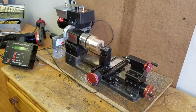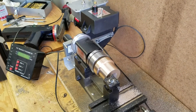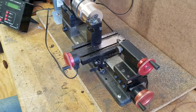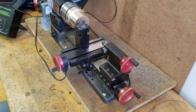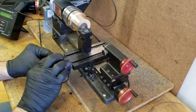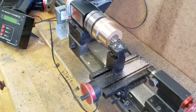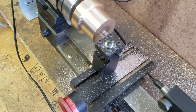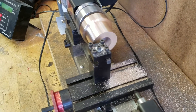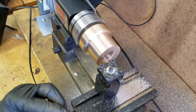Here, as you see, we are making the actual radiator cap. We have the old Kissel 6-38 radiator that we procured, but there wasn't a radiator cap and the neck of that radiator had pretty bad threads in it. So part of what you're looking at is the fact that I've made the portion which is going to be threaded — that's the portion we're boring — extra long, in case we decided we were going to thread it that far onto the radiator neck. However, as we researched this more, we came to the conclusion it was highly unlikely that they made the radiator neck as long as you see here. Nonetheless, we're going to continue boring it out to the right size.